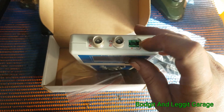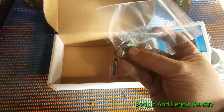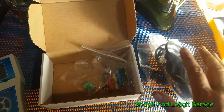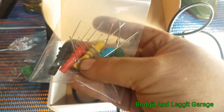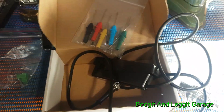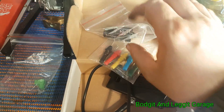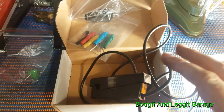We can use the dual input and make our own wires depending on what you want to test — which is really handy. The back probes speak for themselves — we've got some that accept banana jacks and some straight-in connections. We have a 10-to-1 attenuator, which is straightforward enough.